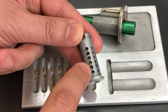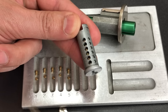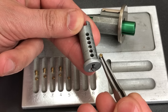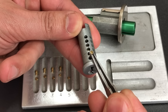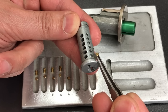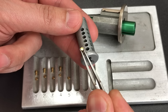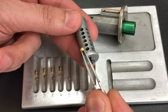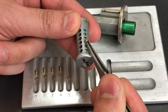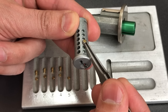What we want to do is insert one of these T-pins with the narrow end facing down, such that if you use the key and the master wafer is outside of the cylinder, this T-pin will just glide over these construction keying holes. However, if you pick the lock, it will be extraordinarily difficult to get all of the master wafers above the shear line, which means when you turn the cylinder, these T-pins will drop into the construction keying hole and seize the lock up.